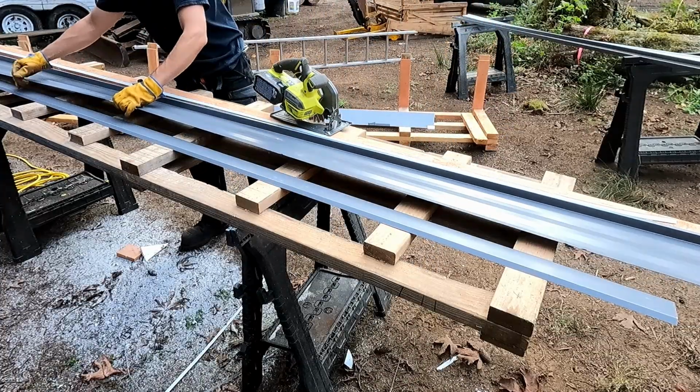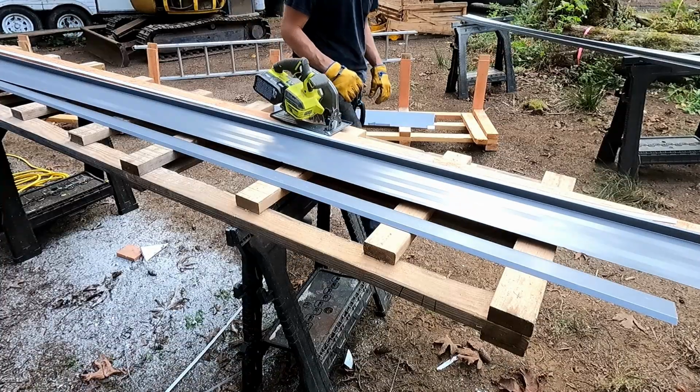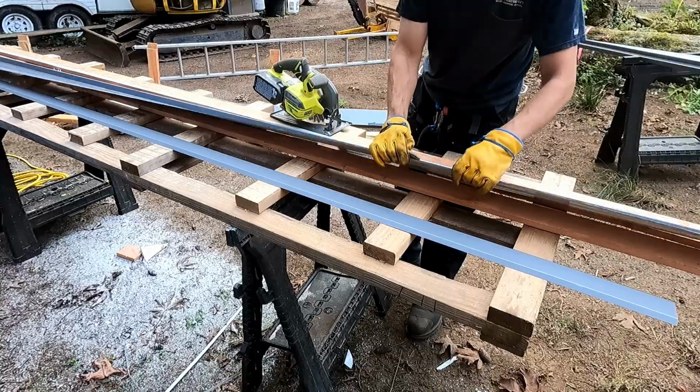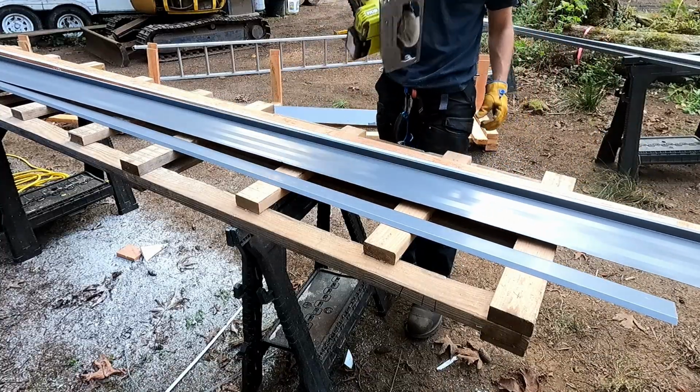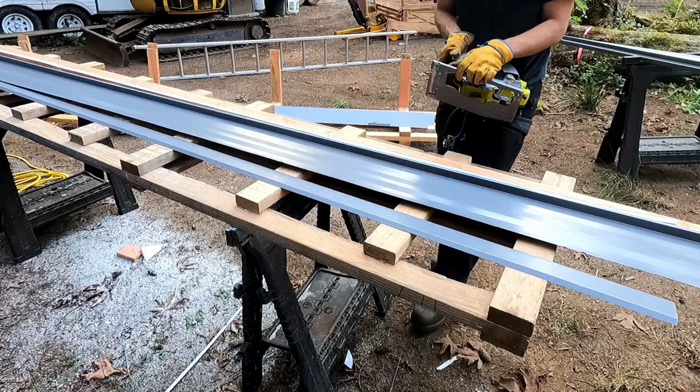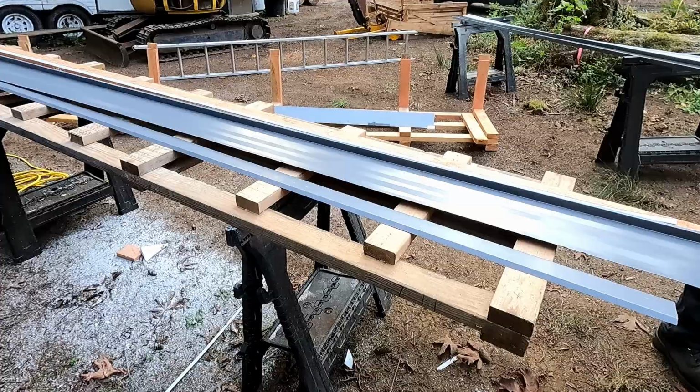And there's a burr, but it's not terrible. And then the kerf got smaller, heat got worse, and the burr got a lot worse. And I sort of suspected it, and I look at this and see, I have knocked, can you see that? Probably not. I have knocked every single carbide insert off of this blade.